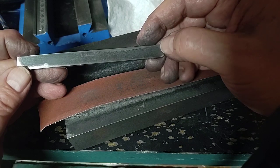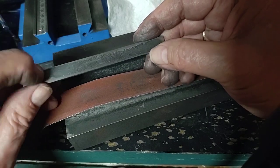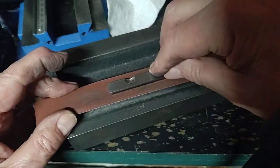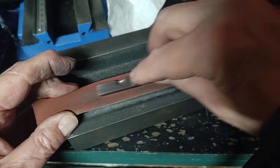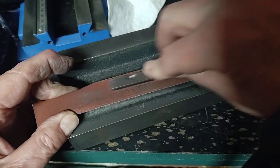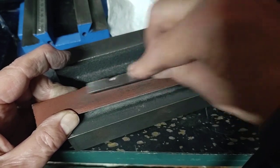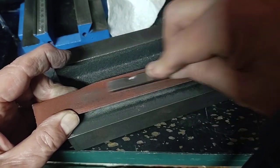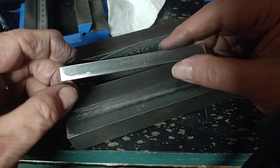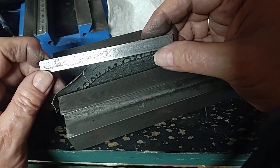As you can see, this piece is not flat in any way, shape, or form. It's got divots. This little dot right here is from the screw on the other side. On these machines, on these tables, the basic stuff is good heavy casting — they're reasonably well machined and seem to be reasonably square — but they are coarse and crude, and so it requires a fine amount of fettling. Lovely word, fettling — old English, means to fit or to prepare. And that's what I'm doing.